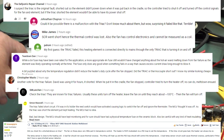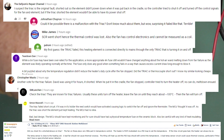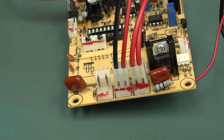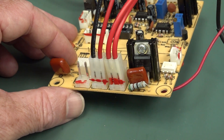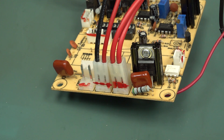A lot of people in the comments for the previous video said it is the TRIAC — a BTA16/600V TRIAC, which is here. It's a pretty decent one from ST, designed for medium power applications. And it looks to be a genuine one, not a knockoff. A lot of people said the TRIAC failed short. Sure enough, if the TRIAC actually failed short, there's nothing the processor could do via the gate control optocoupler — it couldn't switch it off. But I actually measured the anodes on the TRIAC and it's not shorted.